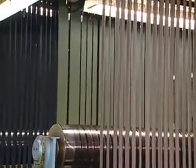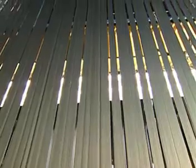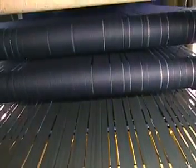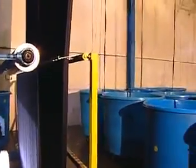When the yarn is out of the first dip box, it starts out as a yellow color, which is the reduced or soluble form. When it is raised in the air by rollers, called skying, the color oxidizes into a light shade of blue. With each dip, the shade darkens until the desired depth is achieved.